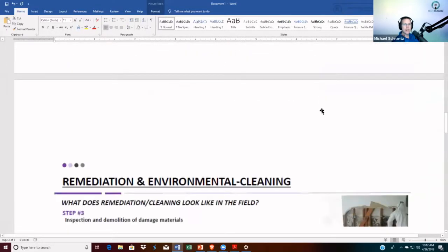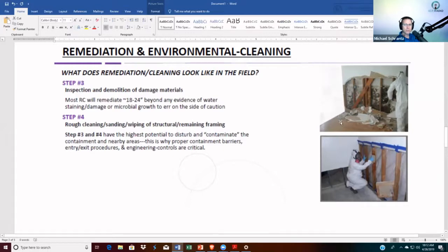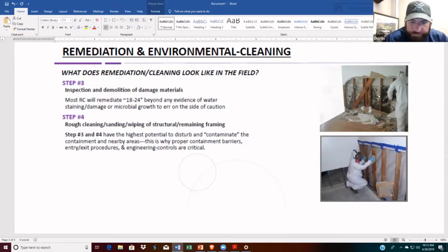On certain projects we'll screw in one-by-two strips of wood into the ceiling just to help hold up the top of the containment, especially with high ceilings of 15 to 17 feet where the weight of the plastic pulling down is significant. Anything you can do to ensure the containment stays up is the biggest thing, because if you don't have a good containment, whatever machine you have in there, whatever you're exhausting outdoors — none of it matters anyway.